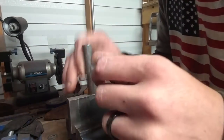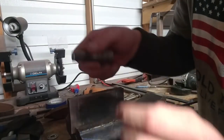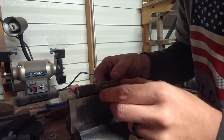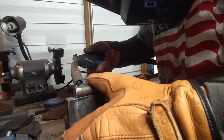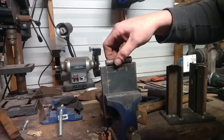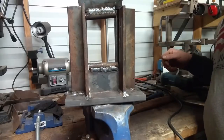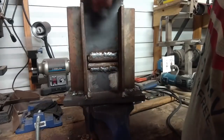I'm going to get them welded. I've got my round stock, my half inch stock cut down to two and seven eighths inch, just so it fits just inside these lines here — that's our frame. I took and ground a flat spot on it so it sits on here nice and flat. Now we're going to weld it down both sides of this, and the same with our top die. I have another piece I'm going to put in the vise and weld as well. Next we're going to weld our little tabs on here.